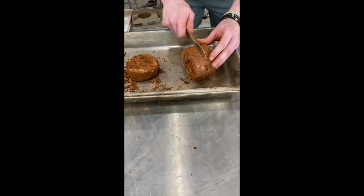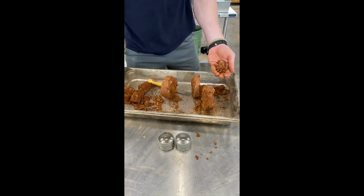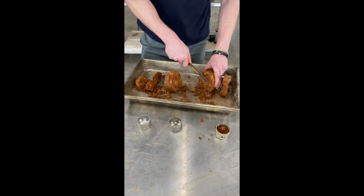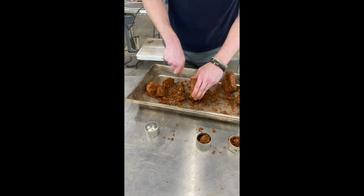After cutting the sample where scored, collect at least 50 grams of soil sample from either side on the inside of each chunk and place into one of the 3 labeled tins, collecting a portion of the whole from along each of the 3 cuts.